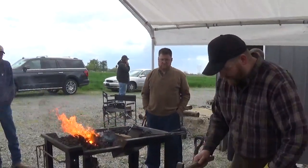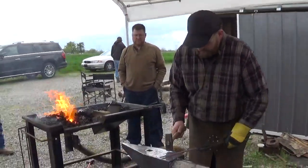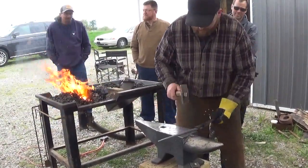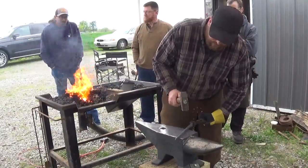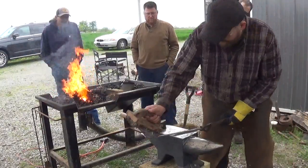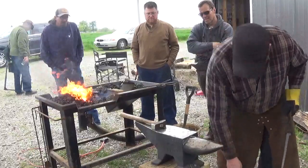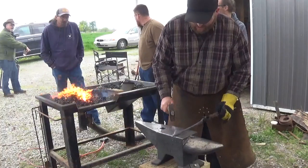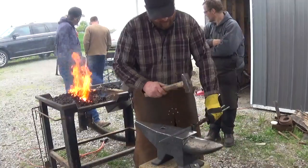This exercise isn't supposed to be about me drawing forever. I can keep drawing this out longer and thinner if I'd like. I'm going to leave it where it is and move on to the next step. If anybody wants to get around to forging and have a play with it, you can. In my shop I have a power hammer — so I do the part that's necessary by hand, and then go under the power hammer or press to do the grunt work.